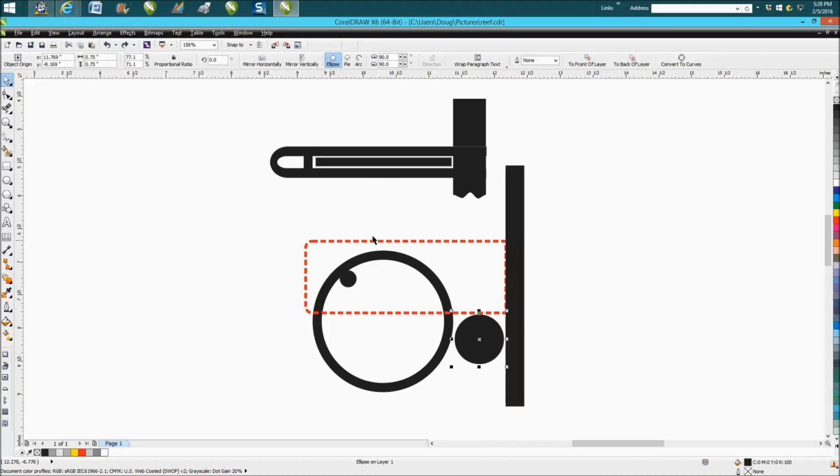So after you've built this, you want to lay it, and if your gate and your wall or your fence and your gate are on the same plane, they're both equal, then all you have to do is cut this where this bar is going to fit into this hole right here. Now, on one of the videos, I actually had my tack room, and it was almost a 3/4 inch piece of plywood. So I had to lay down a piece of plywood to make my measurement there.